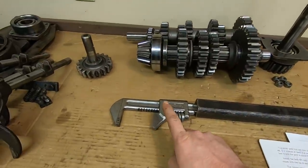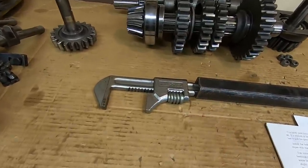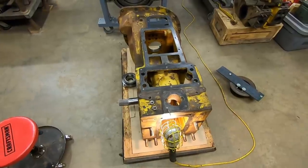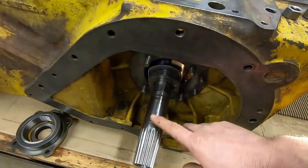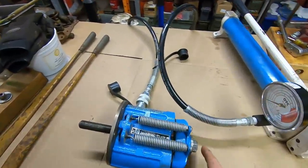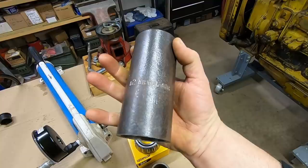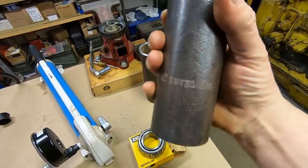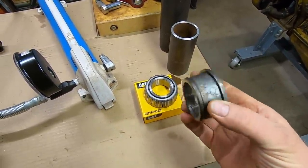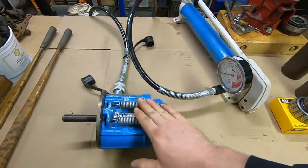They're definitely not using an adjustable wrench like mine to achieve 700 to 750 pound-feet — that probably tops out around 250 and it's getting ready to spread. Anyway, if you have the wrench to do it you don't need hydraulics. We're at the point now where we need to press the new left-side bearing on until it bottoms out, using the hollow ram again — pretty much the same setup as installing the hub, except with a smaller piece of pipe made for pushing bearings on. I have 'D2 bevel bearing' stamped on it. Same arrangement: I'll use the old bearing race as a driver on the new one, and the piece of pipe goes onto the hollow ram and pushes it on.